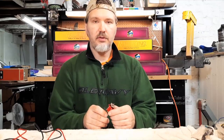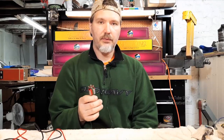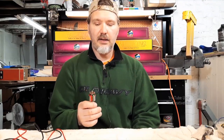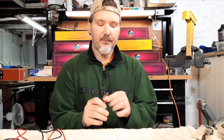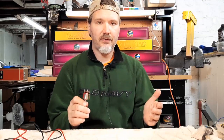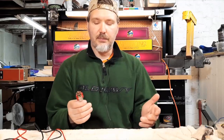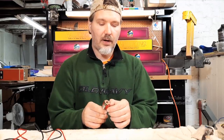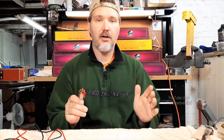So we're going to rewind all three segments of this armature. The reason why I'm doing all three segments is because in case the other two segments are damaged at the factory and I didn't know about it, I'd rather take care of those issues now rather than have to take apart the locomotive again to get to this armature and rewind these segments. There could have been other damaged wire in these segments, so let's fix it all now.